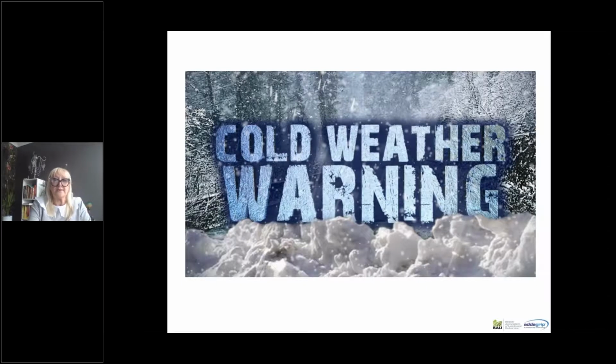Cold weather: everybody through the winter months is not installing very much resin bound surfacing at all, because of the sort of weather that we have in this country. And if there is a cold weather warning, we need to be aware. Now, what we have as an add-on for our products is a catalyst, so you can control the cure rate of our resins. So in cold temperatures, when it is down to 5, 6, 7 degrees, if you know that there's going to be rain later in the day or overnight, you can actually speed up and control the cure rate of the resin, which makes it very useful for contractors at the end of the day in the winter months, and it allows them that control to ensure that the product is cured before it can be attacked by cold weather.